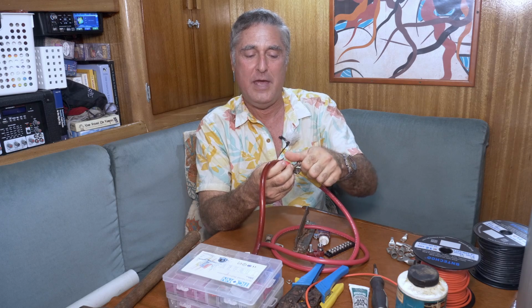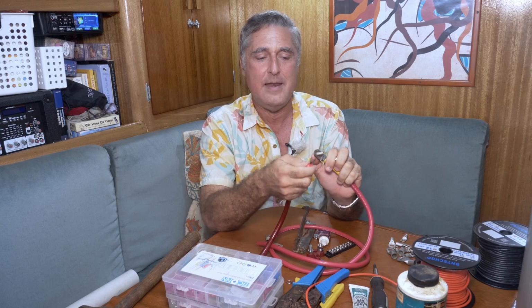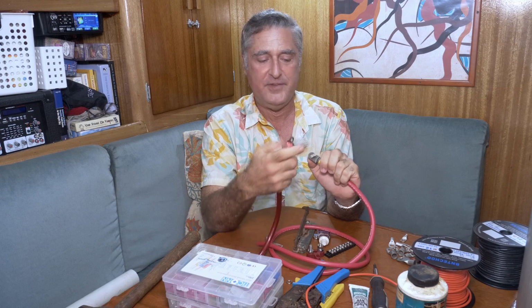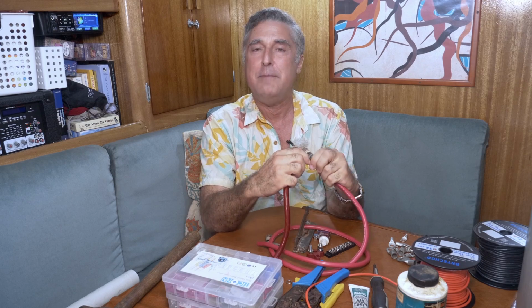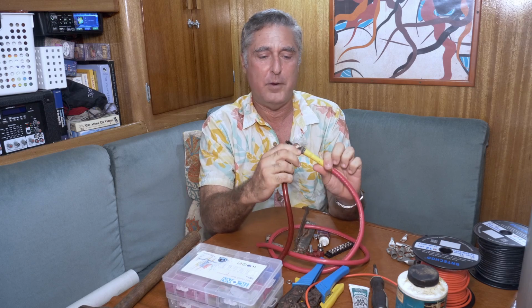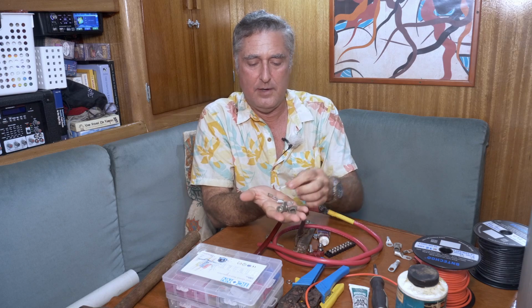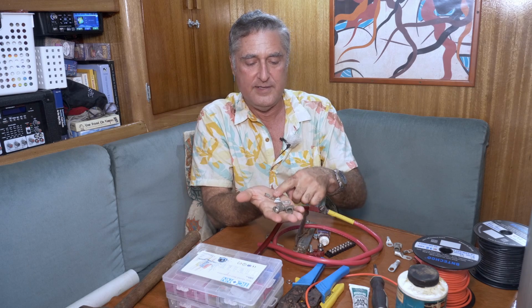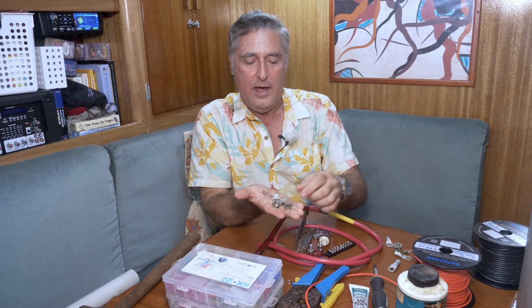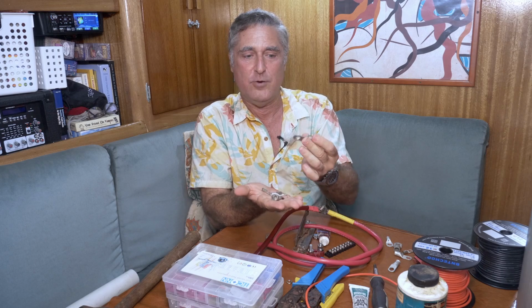So if you suspect a problem, or if you're using old copper or reconnecting, make sure it's clean. Take some sandpaper and clean both sides of all these terminals and then put them together. Don't put corroded terminals together. You will have problems. These big terminals, just like the little plastic colored ones, come in all different sizes, but since they don't have plastic, they go by actual printing on them. For every wire gauge that you could possibly buy, right up to great huge ones, there are terminals.